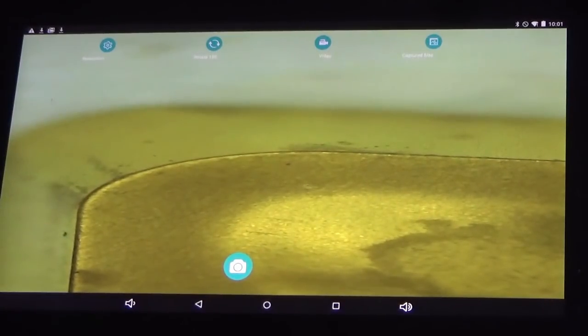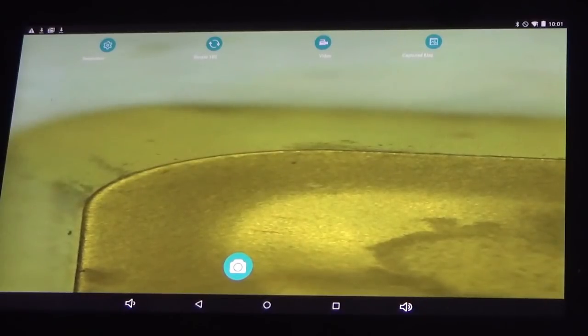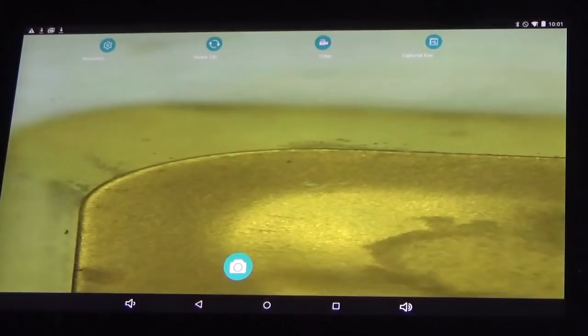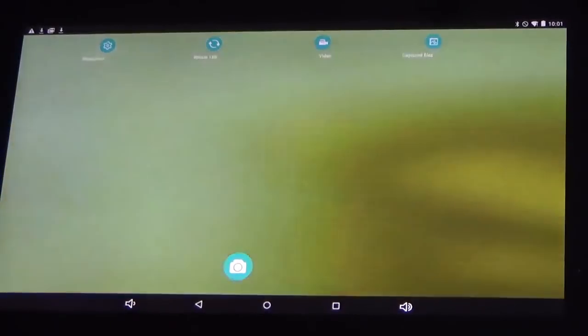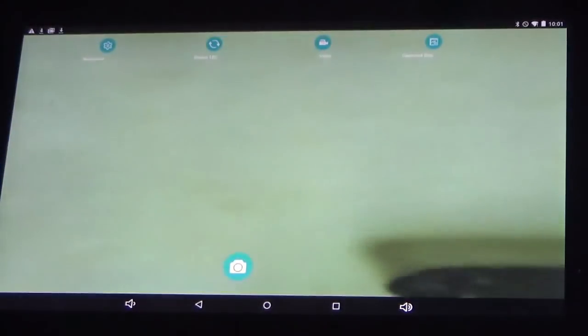And if you look at the cutting edge there, what you can see is it's actually blunt. It's what you would class as a blunt cutting edge. If you tried to wipe this across your fingers, it would not really cut your skin. It's completely blunt. So this is the back edge of the knife that we were talking about. And that's a CNMG insert. You can get different inserts. So we'll move on to a V-style insert.